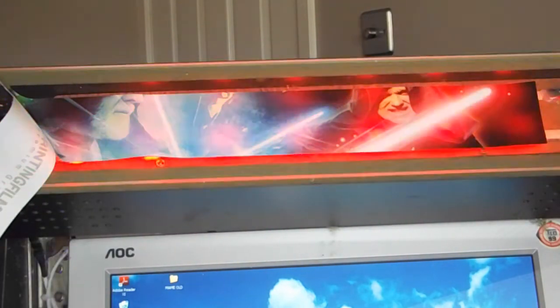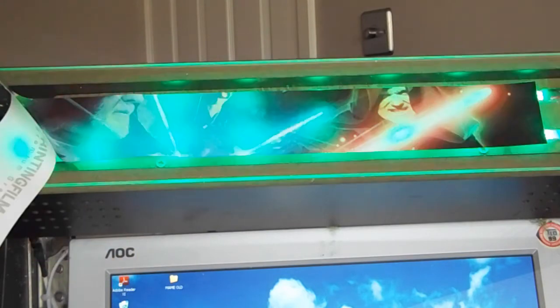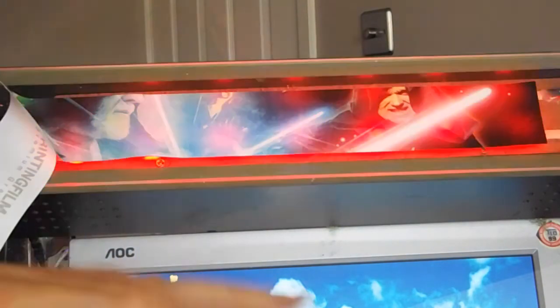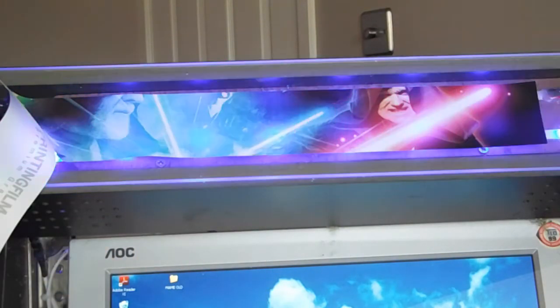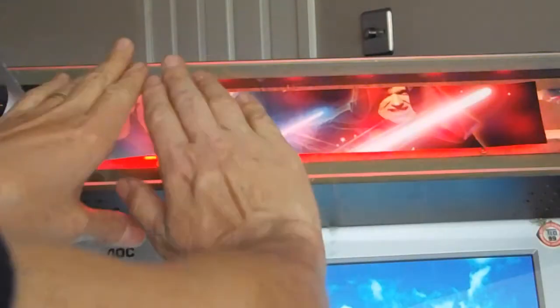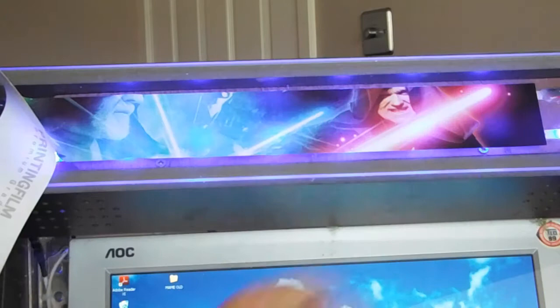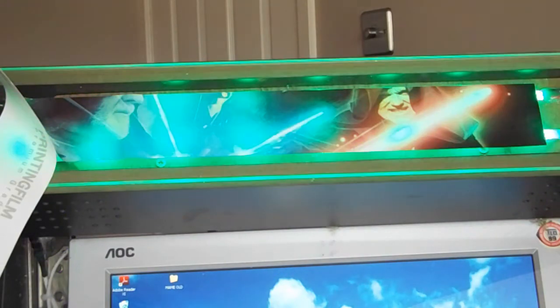I think that's my next job - just to mount the transfer. I shall do it wet again like I did on all the others. I won't bother showing you that because you've seen that process. You wet the plastic down, lay the vinyl out, squeeze out all the water which gets rid of all the dust, and then that will go on perfectly.